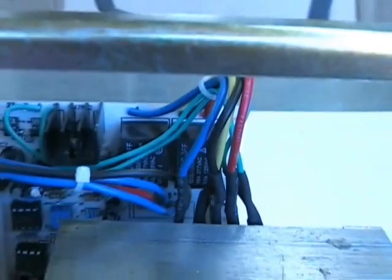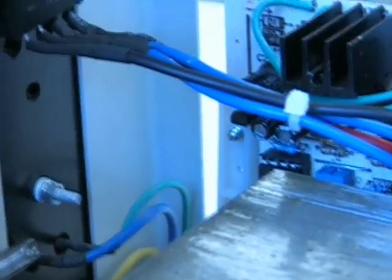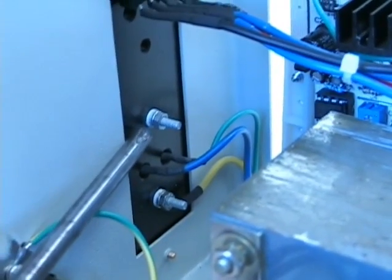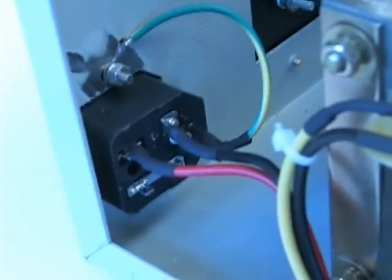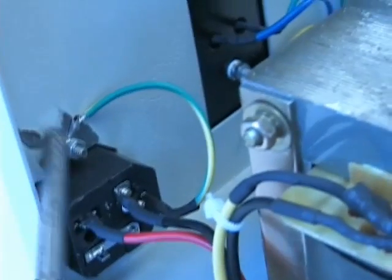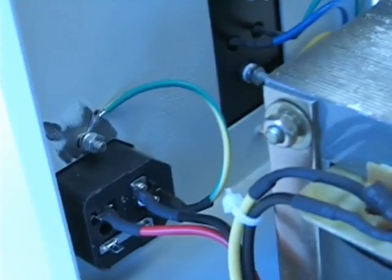It looks like they're probably op amps — I can't read the number — but most likely they've got some trim pots for setting things. There's a couple of relays, as you'd expect, to switch the output taps. This is your bridge rectifier, and you've got your series pass output transistor there — they're both on the heat sinks. They actually use spring washers and insulators, so that's actually done right. They've scraped away the paint on the chassis to get a good earth connection — that's done right. Once again there's a spring washer in there.